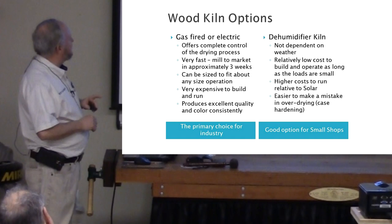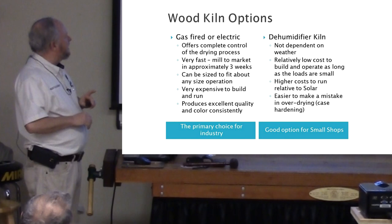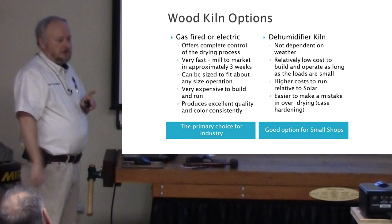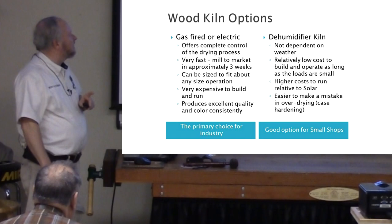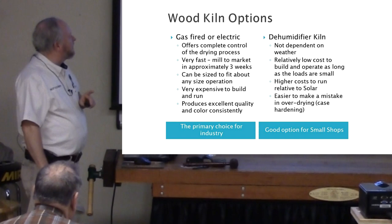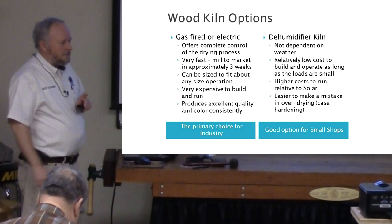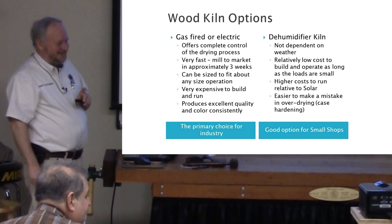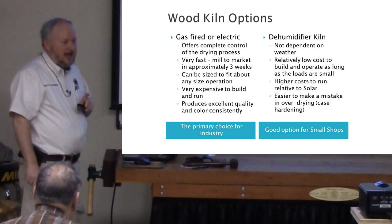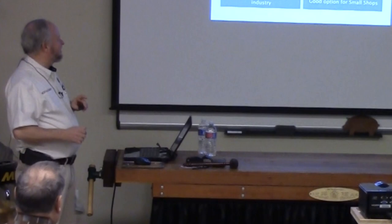There are a lot of options out there for kilns. The first is what most industry uses: old gas-fired or electric kilns with complete control. They're very fast — you can go from the tree standing to market in about three weeks. They can be as big as big buildings, fitting thousands of board feet, but they're very expensive to build even on a small scale. They produce excellent quality wood, but a lot of people don't like kiln-dried wood because they dry it so fast it gets case-hardened, meaning the surface layer is very hard compared to the inside, and the interior water can't get out — until you split it.